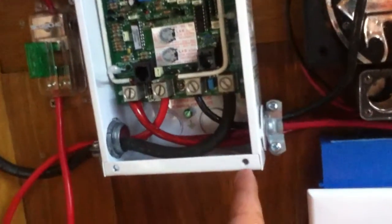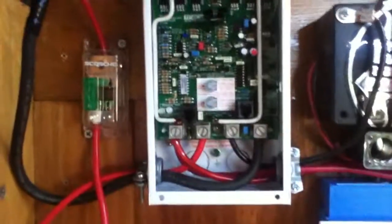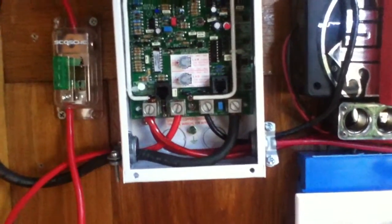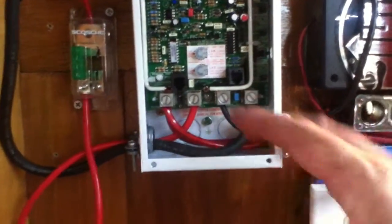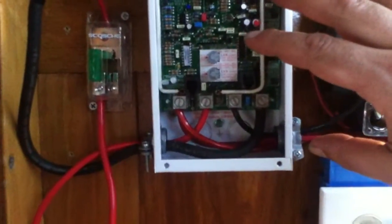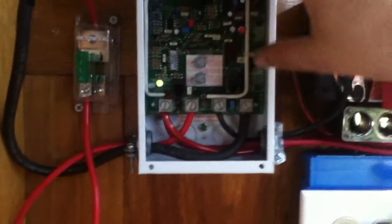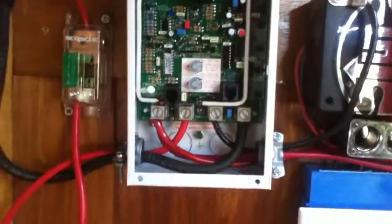You can choose which way you want to go on the knockouts, and the knockouts are three-quarter inch. You want to be really, really careful with those. It isn't like dealing with a conventional electrical box, even though it looks a lot like it. If you're aggressive with a tool or pliers in there, you can get into trouble — when you're dealing with normal electrical boxes, you just don't have electronic circuit boards open right next to a knockout.